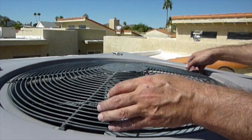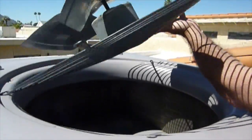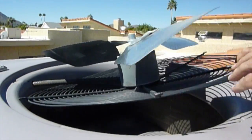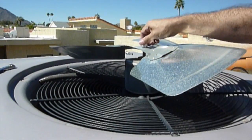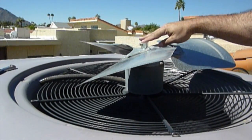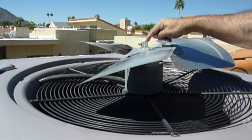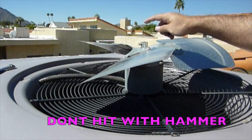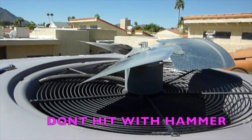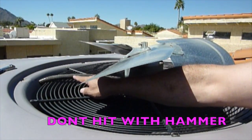To get to this motor, we've got all those screws out around there. Just flip it over — gives you a pretty good work surface. The blade is coming off here; we need to pull this screw out. You probably want to lube it beforehand — put a little WD-40 or something to bust away any rust to make it a little easier on yourself.